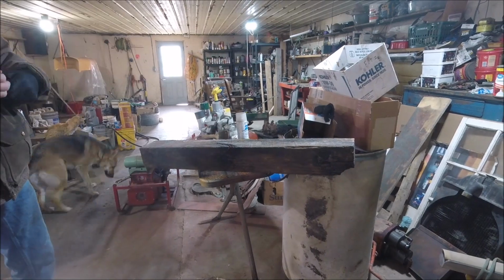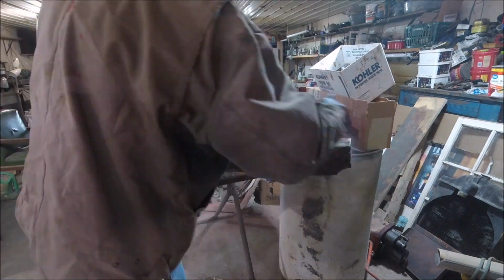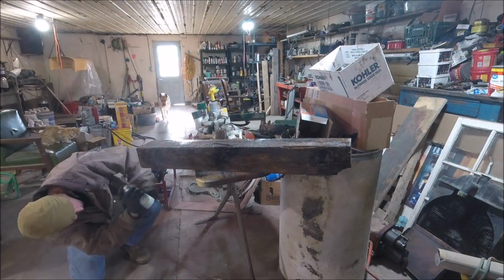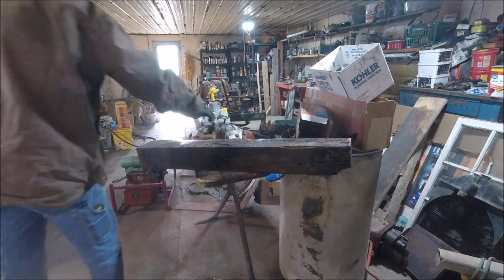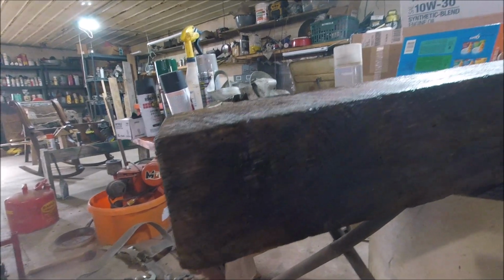So here we go. And then we'll come over here. So I've got flat strap steel. And I'm thinking, so this is gonna be, it's by 1/4 inch, I believe. But alone, it's gonna be too weak. But what I'm gonna do is I'm gonna bend one curve here, and then I'll bend it again here, and then I'll have it come basically at a Z at the wall, and I'll put a 45 reinforcing bit that comes in here. And we'll just space it along here.